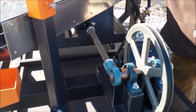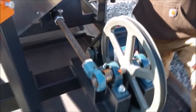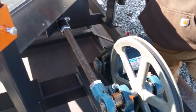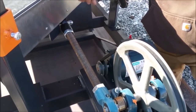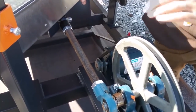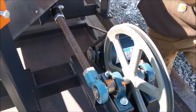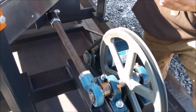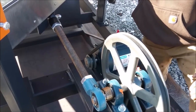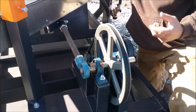It operates at about 325 RPM. There are a few things that are not adjustable on the shaker table: the speed or RPM is constant at 325, and you cannot adjust the throw or the shake — those are all determined by the eccentric shaft. With our shaker table there's no bump or jerk, it's a nice even cyclical movement. We're trying to keep the turbulence on the shaker table as low as possible to capture all that fine gold or dense material.